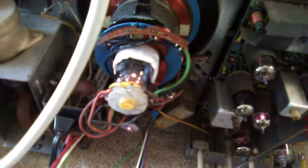But I did flip those two wires on this deflection coil, the green and the red, and the deflection is correct now. So it has a few words up there, whatever they are, readable correctly. But I don't figure an advertisement's going to come on anytime soon, so I'm going to stop it here, pause it, and put this other flyback on there, because as many times as I'm taking that socket off the CRT, it might leak air.